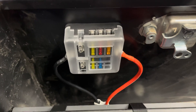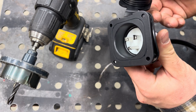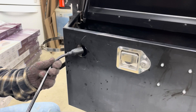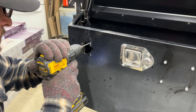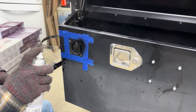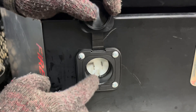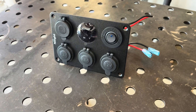Because this battery comes with an AC-to-DC charger, I purchased a panel-mount inlet for 110-volt AC to keep the power station theme — that way I can keep the charger in with the battery at all times and just grab an extension cord when near AC power. The inlet plug is rated at 15 amps. I'll take a 2-inch hole saw to drill the hole, transfer and drill the four mounting holes, paint all bare surfaces, bolt it onto the panel, connect the charger to the inlet, and tie down the charger adapter to the battery for security.